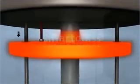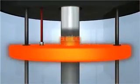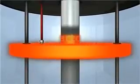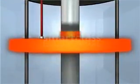As the heater moves to the next zone of the rod, the molten metal of the previous zone gets solidified again. During solidification of the metal, impurities of the zone move to the newly heated zone, or the zone that is in contact with the heater. In other words, as the heater shifts from one zone of the metal rod to another, the impurities also shift to the zone of molten metal.